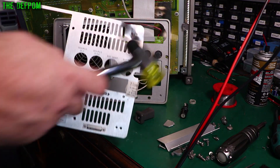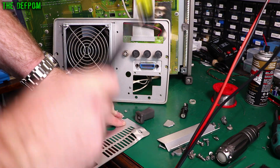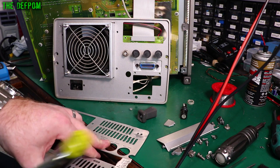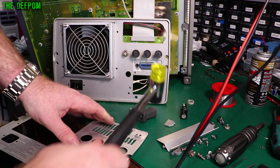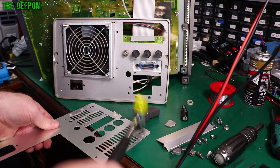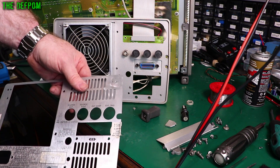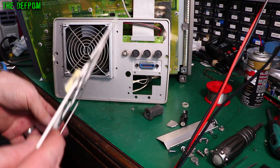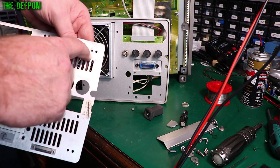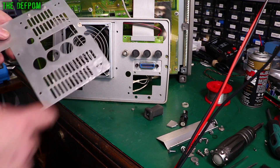So let's try and flatten this thing out. I've already flattened it a little bit. You know these little hammers I was buying - this is why I bought them. It's going to be a bit loud, sorry. Now the problem is being aluminium it's actually stretched a little bit, so I may not want to go right back. It's getting there - still got some more work to do but I'll get there in the end. Well I think that'll do. That's not bad - it's not perfect but it's certainly a lot better than it was. Once I get it in place it should be fairly good. I do still have a crease here but it might not matter - once I get the foot back on it might actually just disappear anyway.